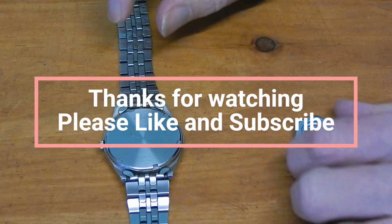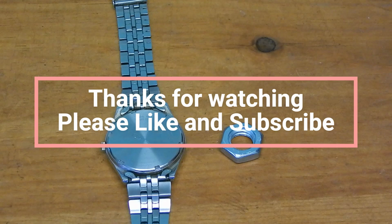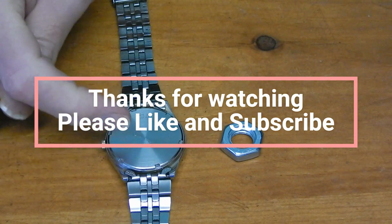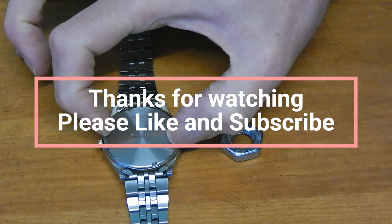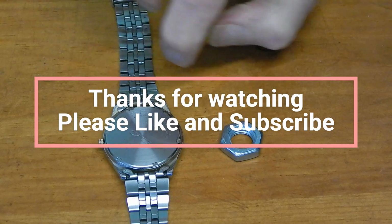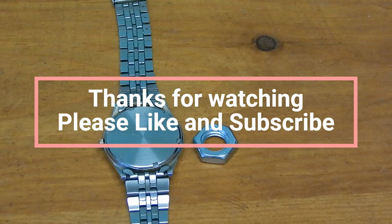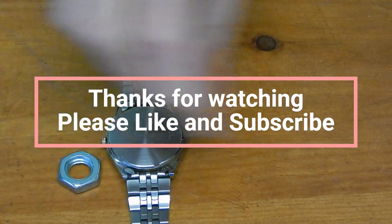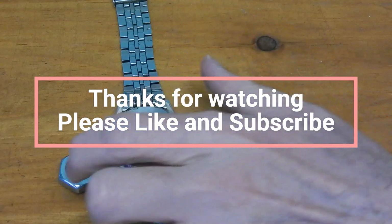To get the back off this watch, the basic problem I've got is I can't get enough torque, turning power, to actually release these watches using other tools, because they're digging into some fairly tight keys here. So what I'm going to use is a good old-fashioned spanner onto a great big nut. So the first thing we need to do is to super glue the nut onto the back of the watch.